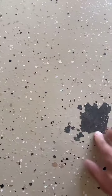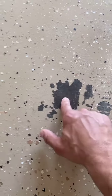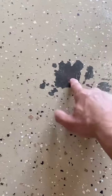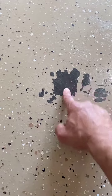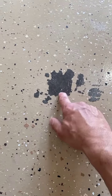Thank God we're able to fix this. We're going to actually grind this off of the floor. If you look here real quick, notice how smooth the surface is beneath this. He never prepped this floor properly. He went and put epoxy on top of a smooth floor. That's the reason why you have this peeling — this product did not adhere properly. This was never sanded, never ground up with a diamond grinder.